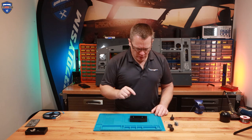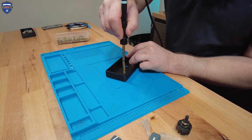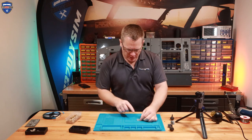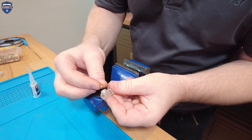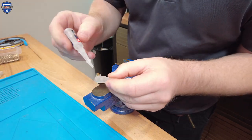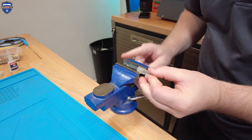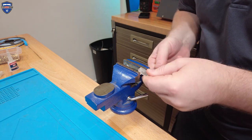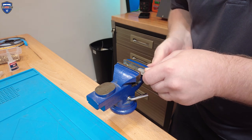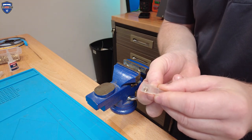Let's do some brass inserts now. We've got the back box, which is the lighting back box, and we're going to gently insert these brass inserts into the back of the box. We've also got some more brass inserts to fit into the adapter shafts. The idea is to push the brass insert and get it started ever so slightly, then use a bit of super glue on the outside, then use the vise to insert it fully.